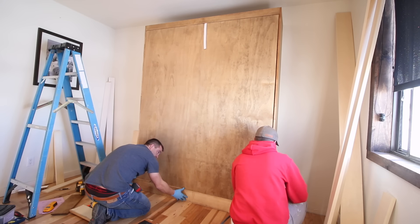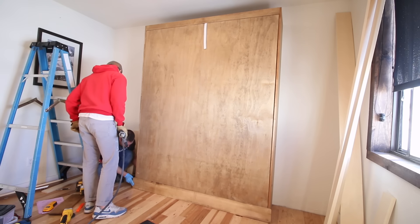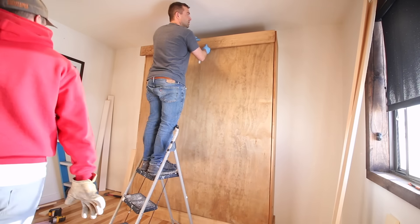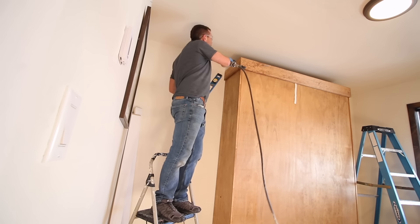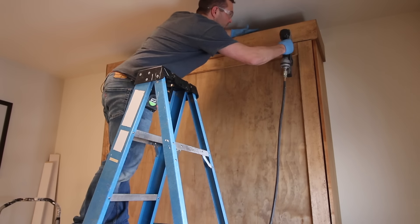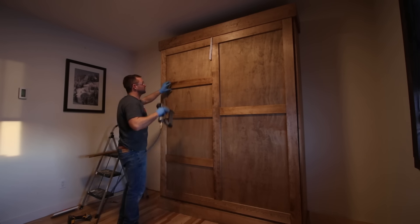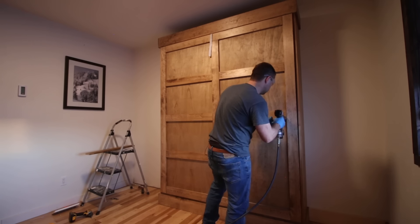You don't have to add trim if you don't want to, but I did want to jazz it up a bit more. We cut a 1x6 board to size and mitered each end with 45-degree cuts, then attached it with three finish nails to each cabinet vertical. Make sure you don't attach it to the face panel since the panel is going to rotate. The baseboard wraps around each side of the unit with a 90-degree cut against the wall. Attach a mitered 1x6 to the header and cabinet verticals — the bottom of the 1x6 should be flush with the bottom of the header, keeping a gap between it and the face panel. There will be about a one-inch space between the bottom of the trim board and the baseboard to allow the bed frame to pivot. I added a center board to cover where the two face panels come together and evenly spaced boards on the left and right to form four panels on each side. You can find the layout and measurements on my website, linked in the description. The trim is all attached using one-and-a-quarter inch brad nails.